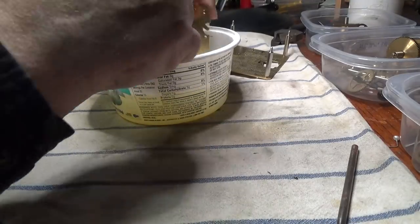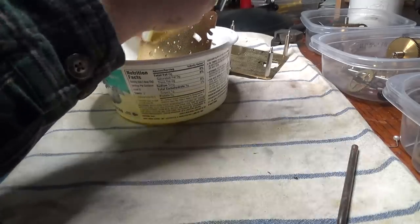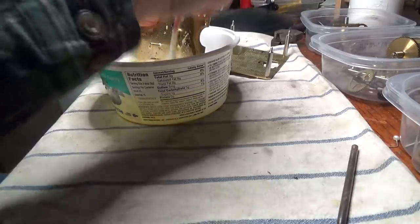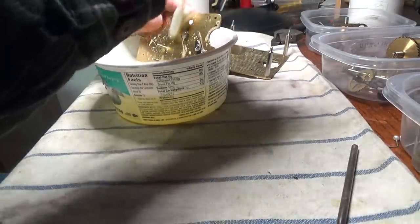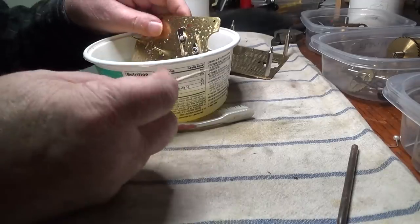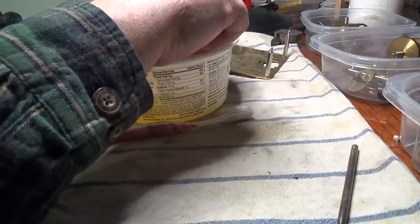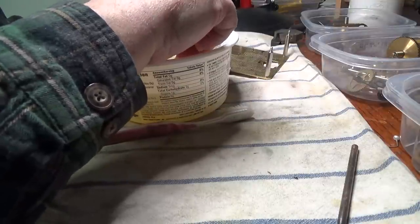That's really all they need. Oh man, I can see the grease running out of the oil holes. And that's how we'll do them, and clean the whole thing this way. Mild scrub. We'll get into the pivot holes. I'll take a toothpick and we'll get into the pivot holes like so, with soapy water. And that's going to clean them.